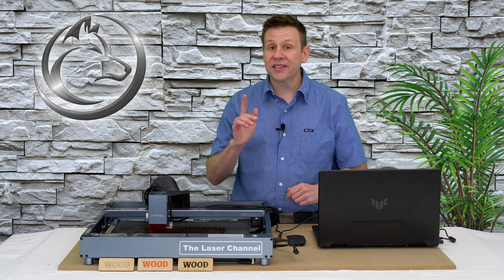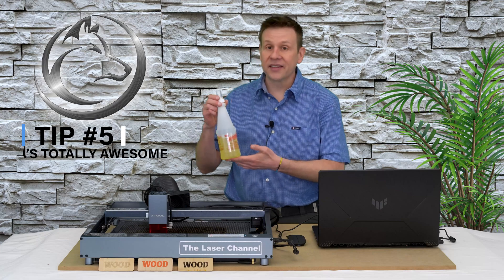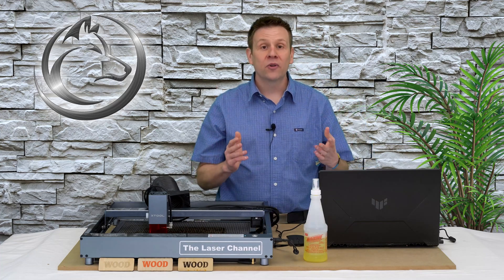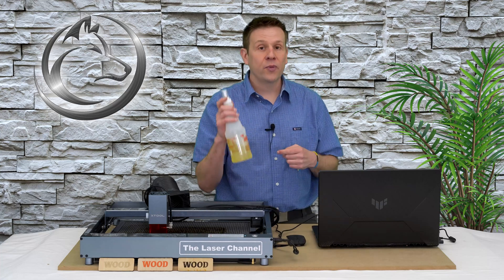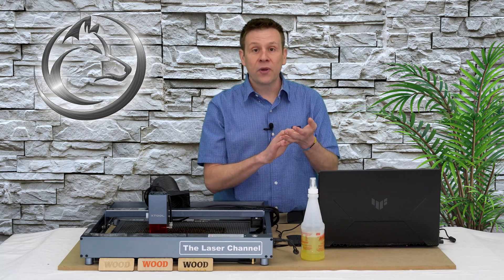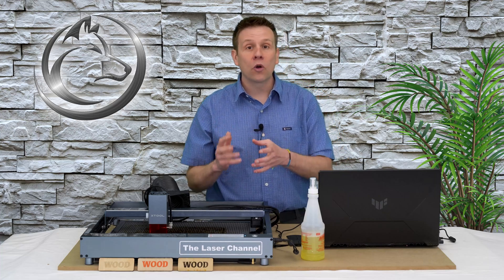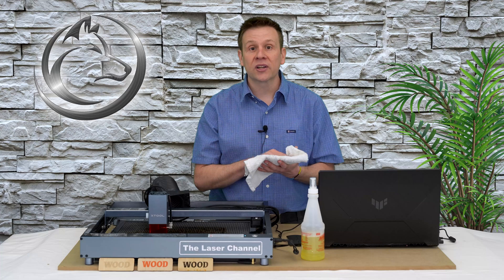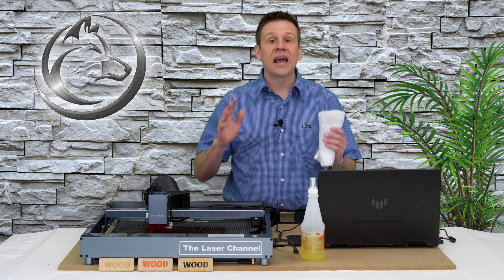My last wood engraving tip — and I think the best tip in this whole video — is how to clean up that wood smoke residue. For this, my go-to product is LA's Totally Awesome. This stuff just melts smoke residue off of any wood project. When using it, I first make sure I have a source of warm water, whether from a sink or a bucket. I'll then saturate my project with the spray bottle, and if I did a cutout I'll even spray the outside cut edge. From there I'll rub my fingers into the engraving or on the outside of the cutout, then immediately start rinsing off that cleaning solution with warm water. Once washed off, I go to a clean dry towel and get all of that water off of my wood project so the wood doesn't absorb the water and start to swell up. This is a method I've been using for a very long time and it works on every wood engraving that I do.